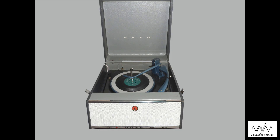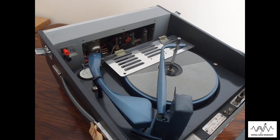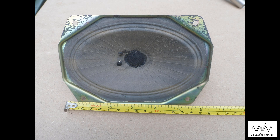The handy thing about having an input like that is a guitarist might want to plug a guitar in there and actually record it through the tertiary output. Tertiary output means it's going through the output transformer and you're getting the sound of the power valves as well as the whole circuitry with the tone circuit and everything else.